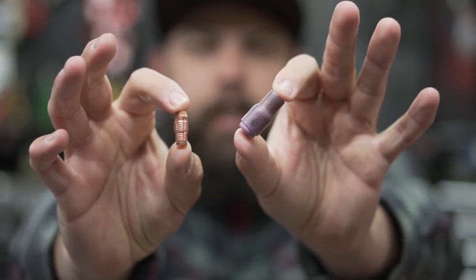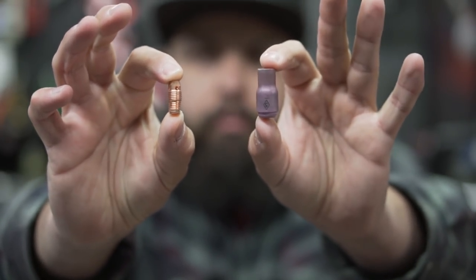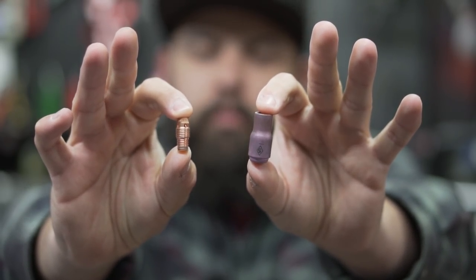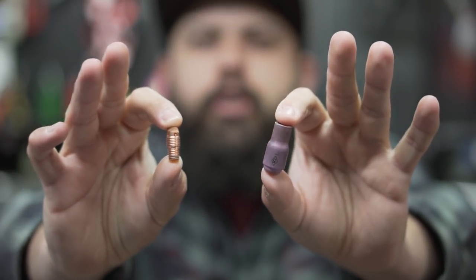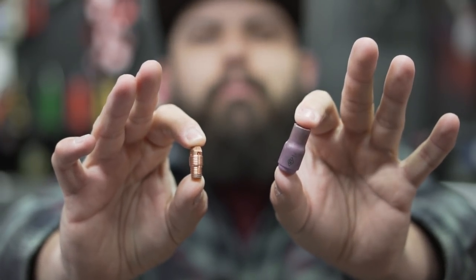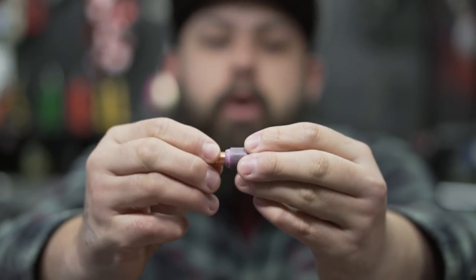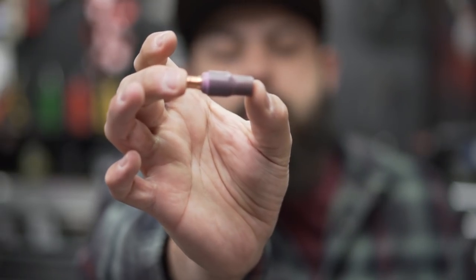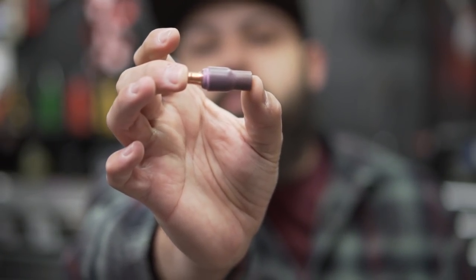This is a standard cup and this is a standard collet body. Now the problem with this setup is that it doesn't really diffuse the gas — it more so dumps it out of the tip of the cup and it's quite turbulent. It doesn't give you that nice smooth blanket of argon over your weld puddle as you're welding. Now there's nothing wrong with this type of cup — people have been using it forever — I'm just saying that I prefer something different.